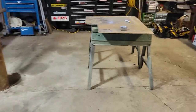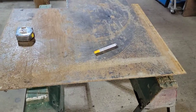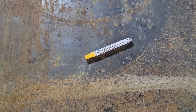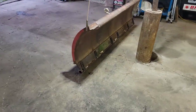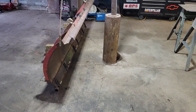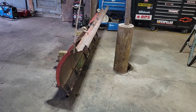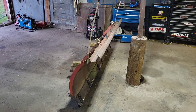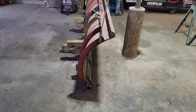I'm going to take this eighth-inch steel plate and basically cut out two rectangle pieces. I already took the measurements — they're 26 inches tall by 18 inches wide — and I'm going to weld those rectangle pieces on the left and right sides. Once they're welded on, I'll take the torch and cut off the excess. I think it's going to be easier because being welded to the plow already, I'll know exactly what excess I want to cut off and how I want to shape it.